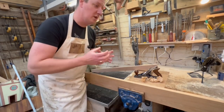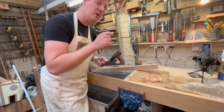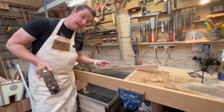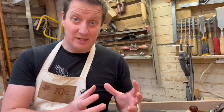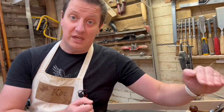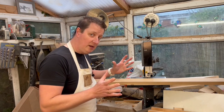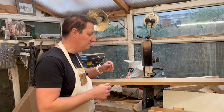The wood will work with you - you're not fighting against the grain. Where I was pulling with the plane on that occasion, I should be able to do exactly the same again. And anyone who tells you you're only allowed to push a plane - ignore them. By checking grain orientation, when I glue these three pieces together I'll be able to plane all in one direction, making it flat for the fretboard and anything else. Time to cut these out - I'll use my little bandsaw, but you could use a handheld jigsaw; it honestly doesn't matter which tool as long as it does the job.